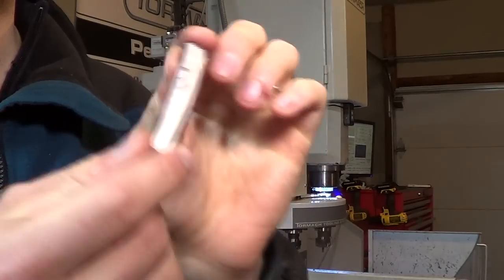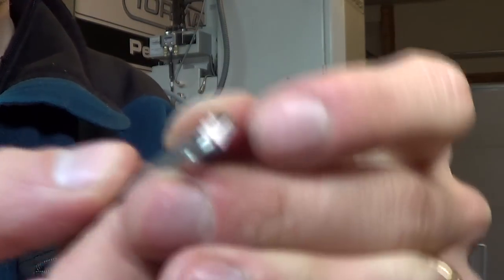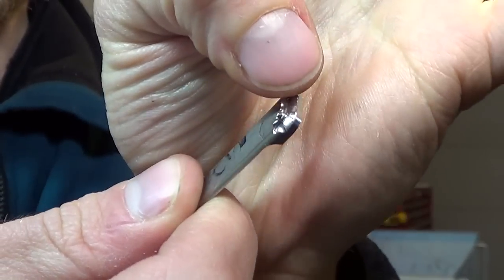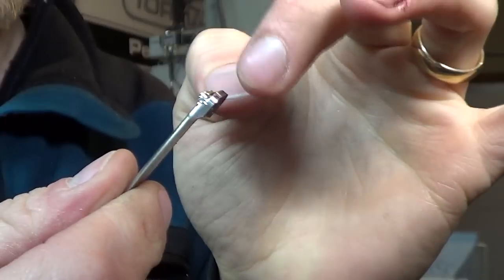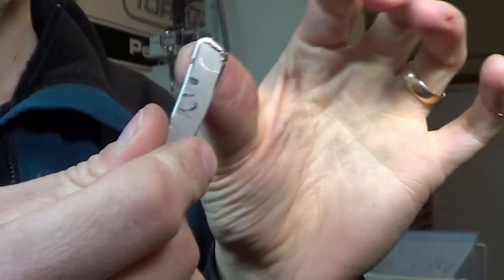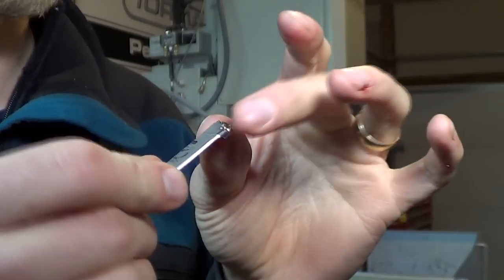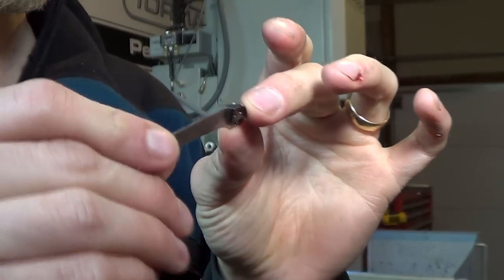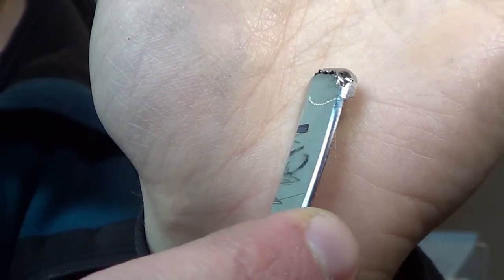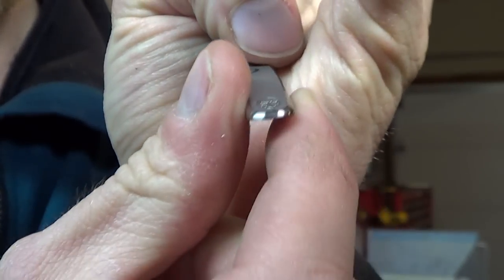So I had mostly good success machining my new pocket clip. The only thing that messed up was the corner rounder. Up at the top there, you can see it undercut right there. I don't know, every time I output corner rounder code for the first time, it's always quite a bit deeper than I expect it to, even though I put the right settings in. It's like I have to manually compensate for it. Anyway, once I changed that, you can see the ugly part at the top, but on the sides, I stopped it before it made too much ugly, and it made the sides really nice, all the way up to the front.